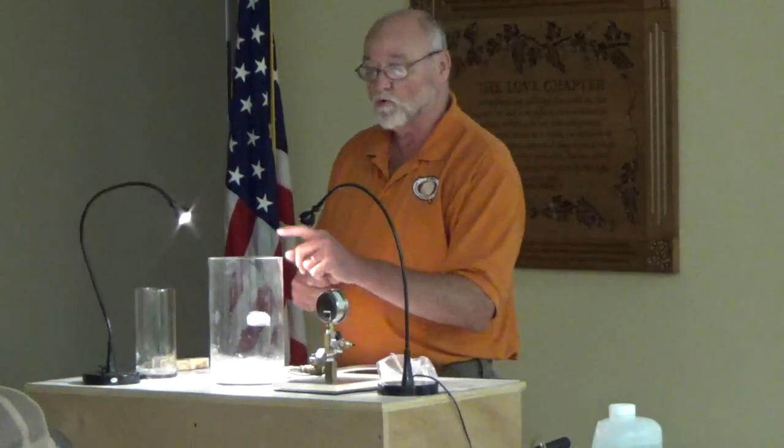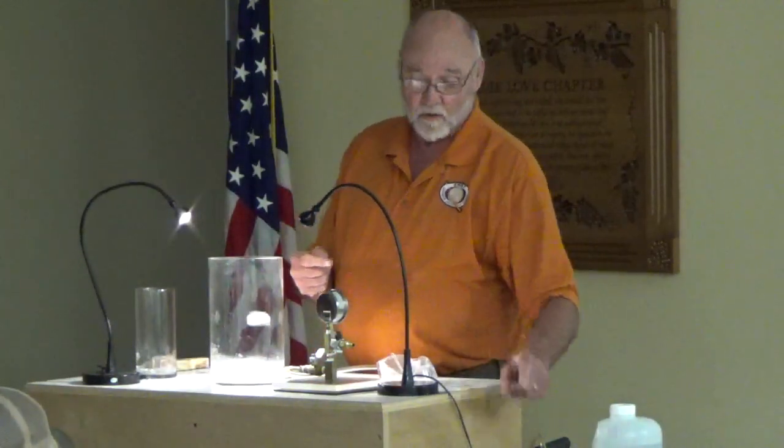So if you make an oops, and you get some of that resin sucked up, and it goes in here, when this is hot, you just ruin your pump. If it's not that hot yet, you can still save the pump. But when it gets hot like that, when you can't touch it, it's 200 degrees, it's done. Most pumps cost 150 to 200 bucks. That's a lot of money.